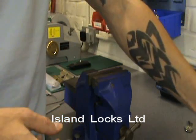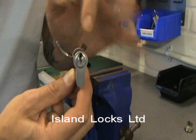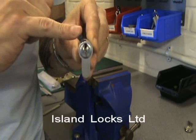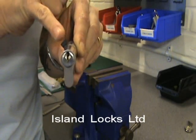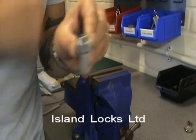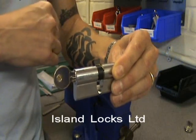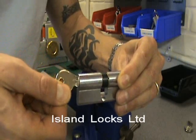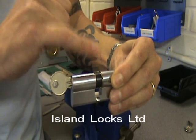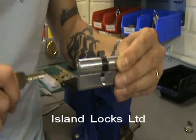On a lock that has a slip cam, when you take the lock out of the door, what you'll find is — with the keyway again in its lock position on both sides — the cam is almost in an upright position, just off to one side. So you can see the cam is in the wrong position. When someone tries to operate this, they pop the key in, lock off the UPVC door, go to turn — so the cam comes round — it wants to do a full 360 degrees, but because of the wrong position of the cam, it's being forced up against the back of the bolt tail. Hence you can't get the key out of the lock, and you have to come all the way back round to get that key back.